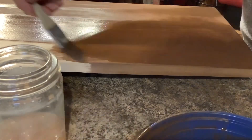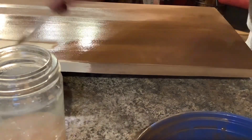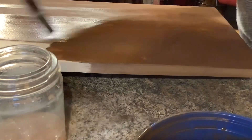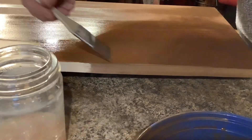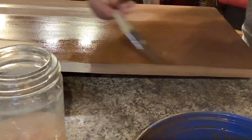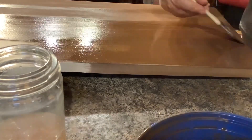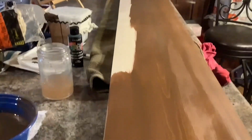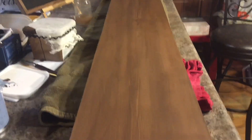So I'm just going in with a water-based stain, and I've gone to a much bigger brush — and it's softer bristled as well. You do not want a firm nylon brush because you will see the brush strokes more. So you'll see me going back very lightly just to hide any brush strokes and make it nice and even. And just showing you — this wood is so beautiful, and that's why I didn't want to paint this sign. I want those grains to show up. So this was the first coat of stain, and I do actually go in with a second coat of stain before I start to clear.